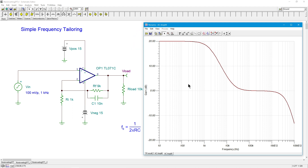Let's do a quick comparison with our first circuit that didn't have the added feedback capacitor. Switching back and forth between these two — the low frequency part and the high frequency part are not changing. What you're really doing is chopping out a section in the middle. If that's where your interference frequencies or noise happen to be, well, that works out pretty well, and it only costs you one small capacitor. If you want something more sophisticated, you'd build an appropriate active filter with really good attenuation in the out-of-band region. But this is a simple, inexpensive, easy way to do something, and if it's sufficient, great.